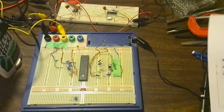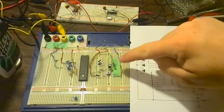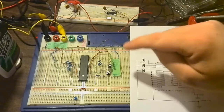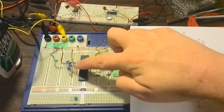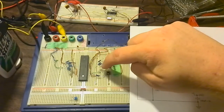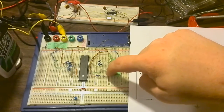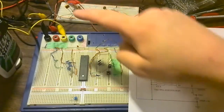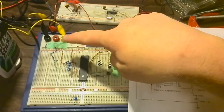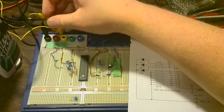So this is what we have here. I have the address lines here, they're in shadow because of the way the light is. These resistors all tie the data lines to ground, and those are the resistors for the LEDs and reset button. I also have the 5 volt power coming daisy chained from this board, and the yellow wire is the clock.